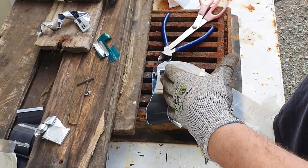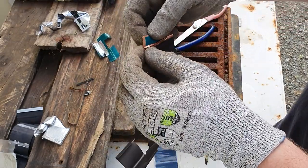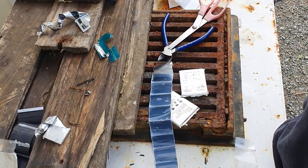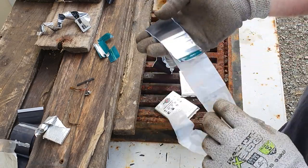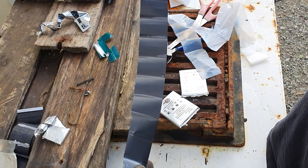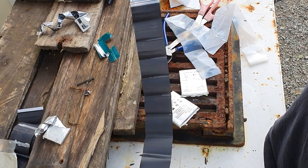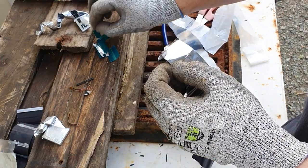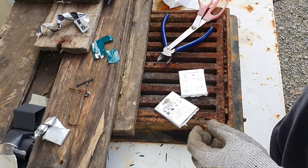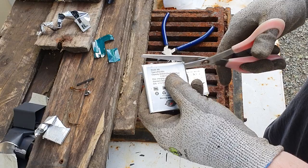So if you just remove the copper side and remove all the electrodes and the tapes, just to clean it up a little bit, put that aside. And this aluminium side — I'm not sure yet, I haven't found an inexpensive way to remove the graphite slash lithium from this side. So I'll hold on to it all for now until I do. And essentially with these ones, these are also aluminium but they're wrapped in plastic.